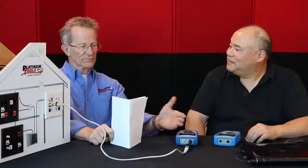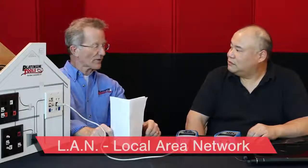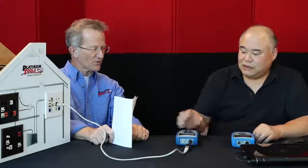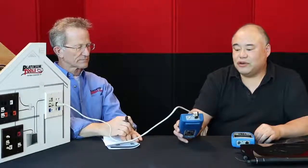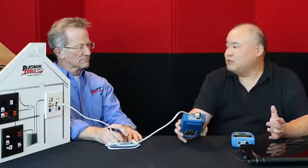Okay, George, so let's go into that first segment, LAN testing, which is local area network, and show us what we do and why we do it. The purpose of LAN testing your local area network is just to make sure that the switch that your cable's connected to is configured so you can communicate with the other devices on the network.